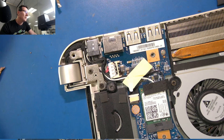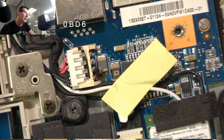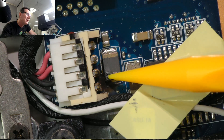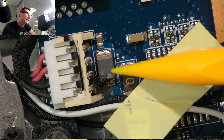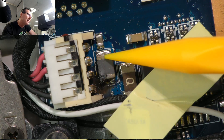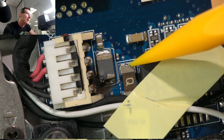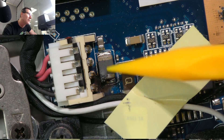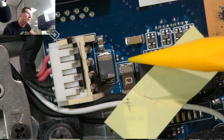Is it arced across? Was there some surge that arced that? Is that our fuse? Let's have a look. Look at that — big blast mark right around there. Is this an input choke? It doesn't look like a cap — they're usually not grey like that. That must be an input inductor. There's a cap going to ground. What I'm going to do is measure the continuity of that surface-mount inductor, and measure from that point to ground to make sure it's not shorted or anything.